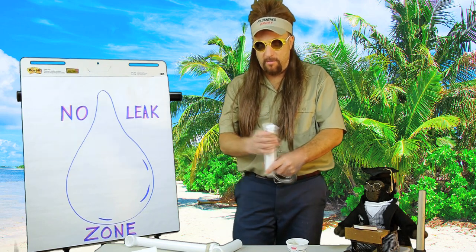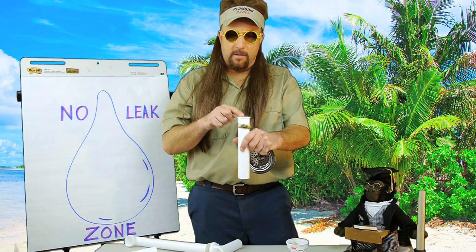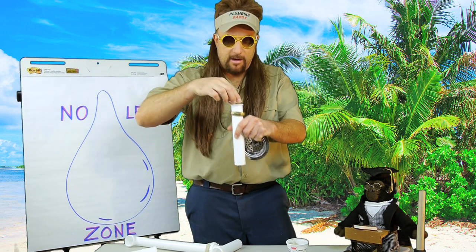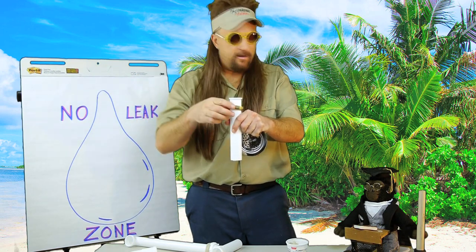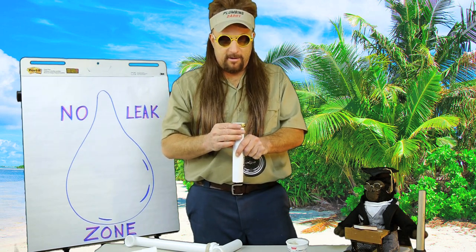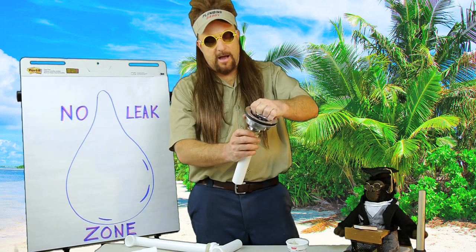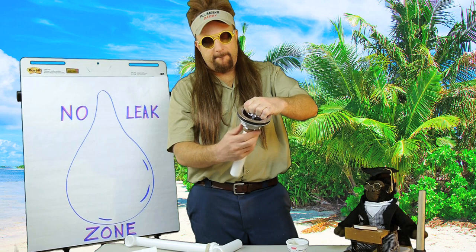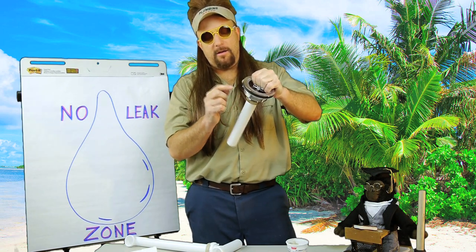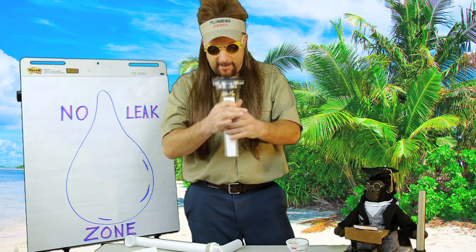We take our metal nut and put it up here. For the tailpiece, it comes down from this sink. There's a special little gasket right there that fits on just like a hat. And then this just ties right on here. This particular one — since it's all metal and it ain't gonna bow up on it — you can snug it a little bit with a wrench right there. It's as simple as that.